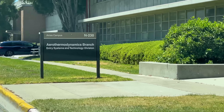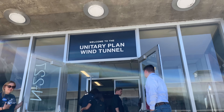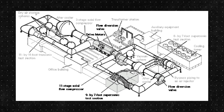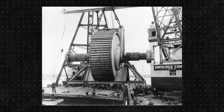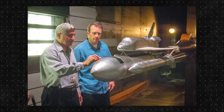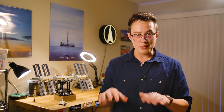One of the other facilities we visited is called the Unitary Plan Wind Tunnel, named that way because it's actually three sections. The power plant — what creates the wind — is a single unit, and the test sections are split up into different sizes with different goals for each. This likely also allows customers to take their time setting up and tearing down models without putting the whole facility out of commission. We briefly talked about wind tunnels two videos ago, and this seems like a great opportunity to dive a little bit deeper.